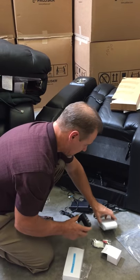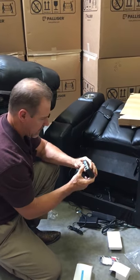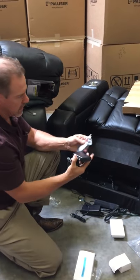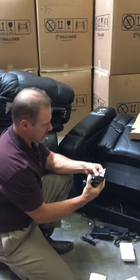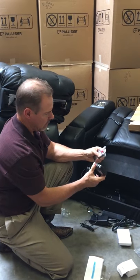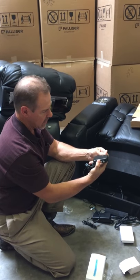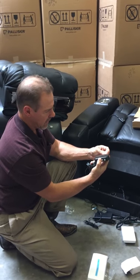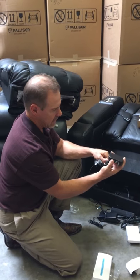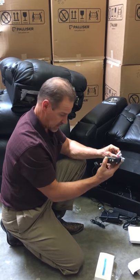The next thing you have to do is take this transducer, power that up, and this will plug into your stereo receiver. They're going to give you a Y cable. If you have a powered subwoofer, you need this — you will plug this into the sub on this end. You'll need to get an RCA cable; these are female and these are female, so you get two male ends. Plug that in here, turn that on, and that will power up your signal to get that going.